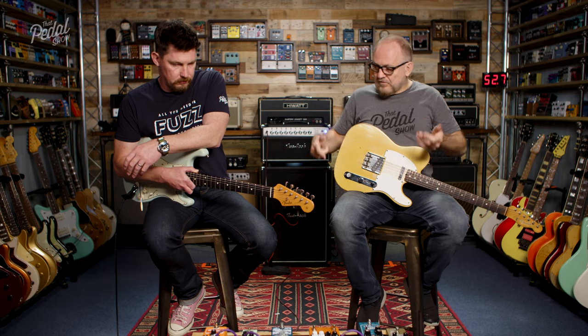With apologies to Una, it is essentially taking away your whole signal run and all the capacitance and loading effect of all of that. But it's so interesting because it's not necessarily what you want. That's the point with buffers: the buffer isn't a magic bullet. I love that you can tailor with the frequency switches and stuff. It's really cool. But the cable capacitance and everything is part of the sound. It can be. And when you get rid of it, it's just different. It's not necessarily better or worse.